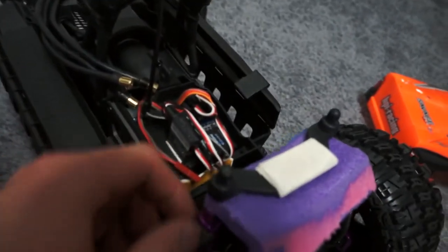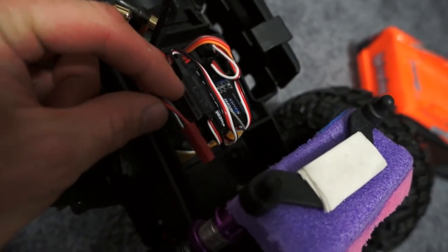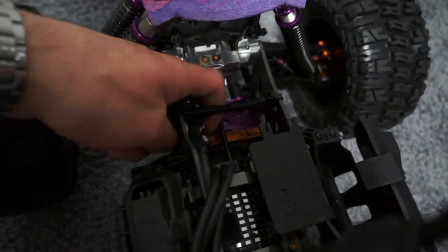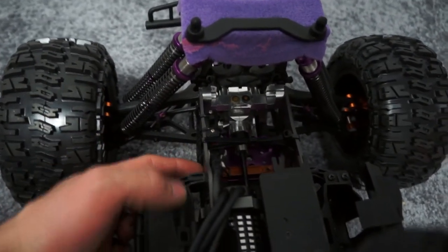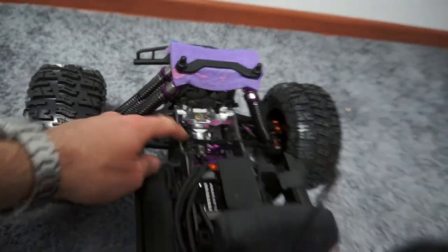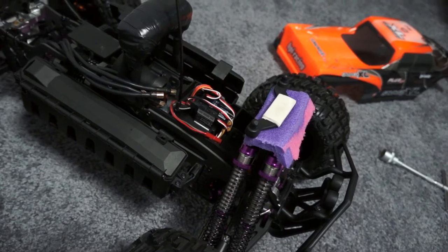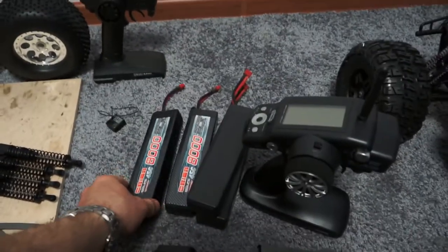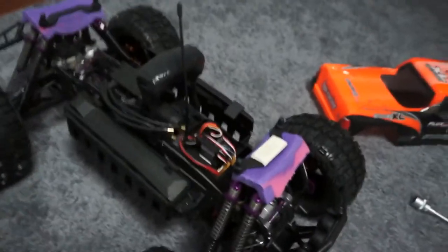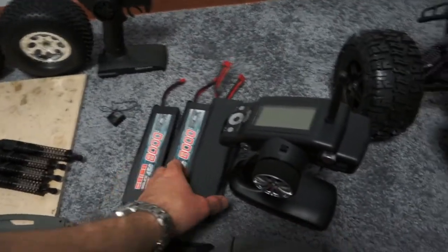for the radio, and I run a LiPo battery, which goes straight here. This is the connector for the LiPo battery, so I connected here, and the wiring goes to the BEC, which is mounted right here. It's all isolated, I run it completely hermetic, so it's waterproof right now. And there is a switch for the radio. The battery I run is 14.8 volts, 800 milliamp hours. It's enough for approximately three sets of these batteries, but I only have two, so I'm covered. I don't need to replace the BEC battery